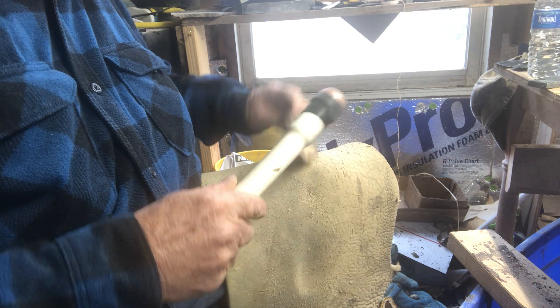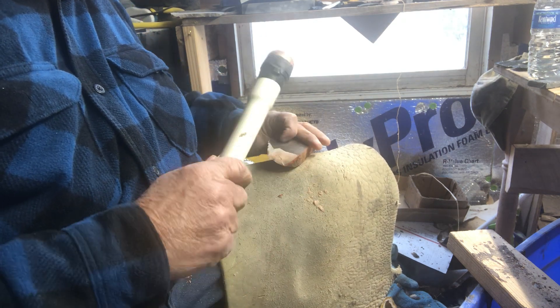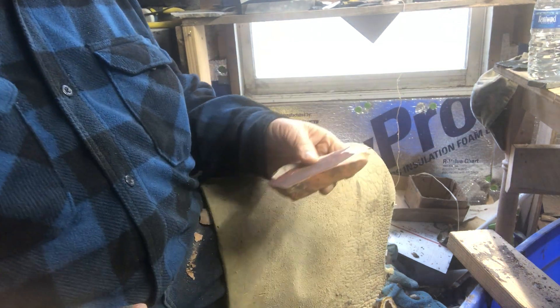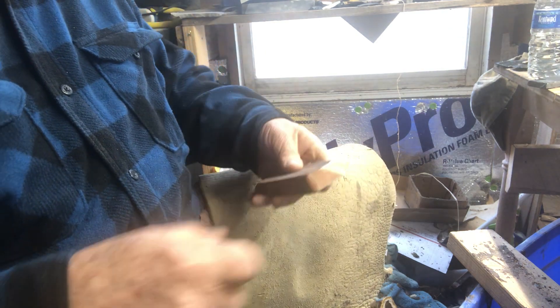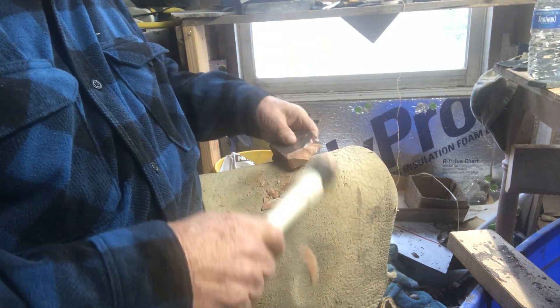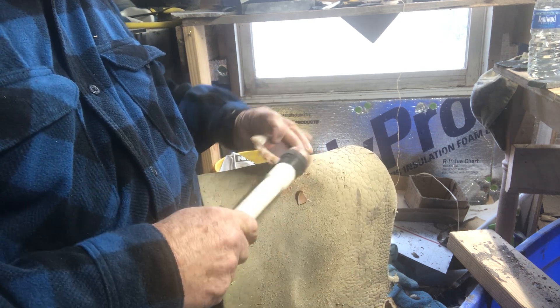What I've learned is you're just going to have probably 80% waste in it. But when you find a solid piece — and it still might have a crack that's not showing right now — it'll turn a sort of light orange color and it chips so good that it takes a high temperature. You've got to run this up about 700 degrees or even a little higher.